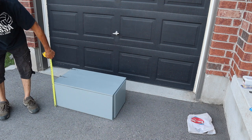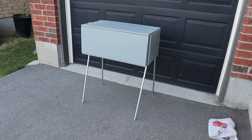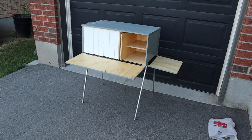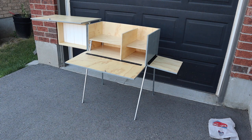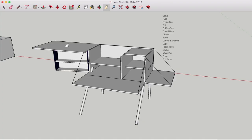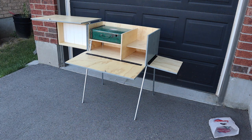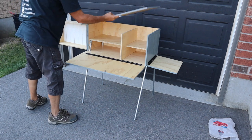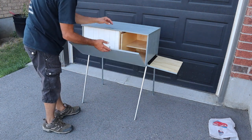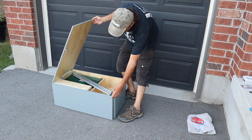One and a half by one by two and a half — looks just like the box in the plan. There's the box on legs, there's the side shelf, there's the front shelf, the spice shelf, and the upper shelf. The legs come through holes in the bottom and are held in place with brackets. I'll need to install some support chains or rope for the extended shelves. But as you see here, the dream is a reality — we have a chuck box that's quite versatile and made with one sheet of half inch plywood. I made sure to place the middle shelf and the middle partition to fit my old camp stove, and you can adjust those locations based on your stove. When you're done, everything just packs up nicely for next time. Lift the box to release the legs and they store inside — how handy.